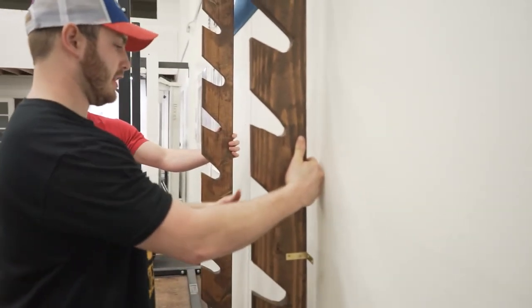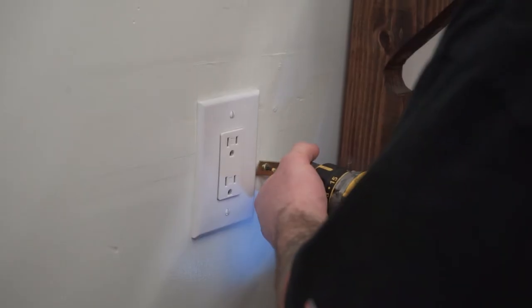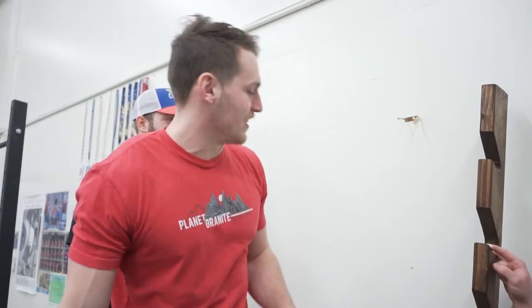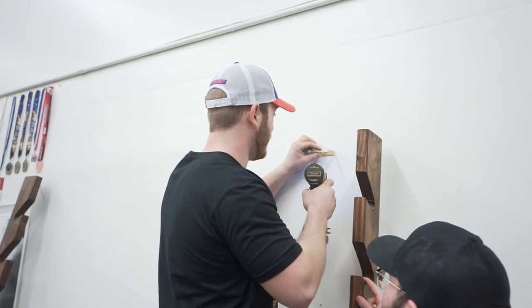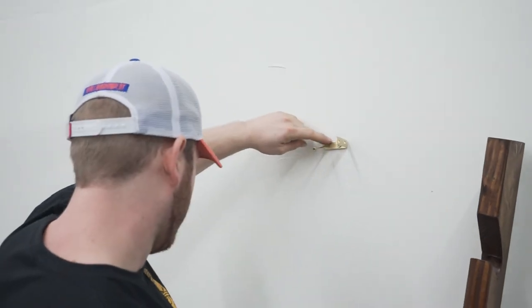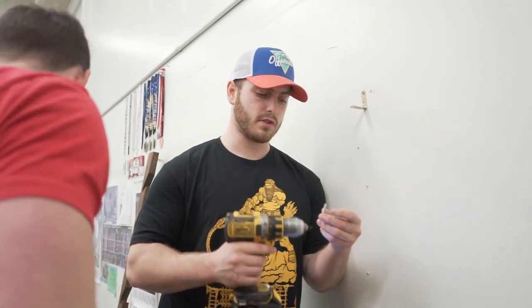If you don't put them on the inside, it's going to be terrifying. There's concern about getting electrocuted. We should take this down for a minute — it's just mudded sheetrock. The other one's not even in the stud. One screw is in the stud, the other isn't. We debated using shorter screws — they should be at least half the current length.